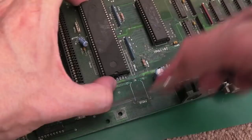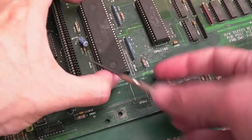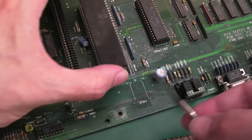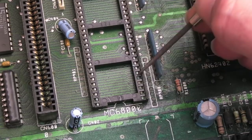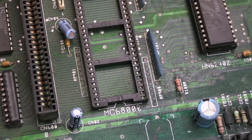Let's get that CPU out and see what the damage is here. The CPU pins are looking a bit grey and green — we can probably clean that up. There are about four or five or six green pins, and one or two more on this side. It's not too bad. There's more damage around here on this one. I've removed the ROM chip and that looks okay; the socket there looks okay too. I'm going to have a good scrub around with some vinegar now.